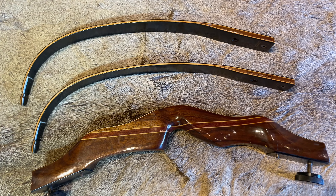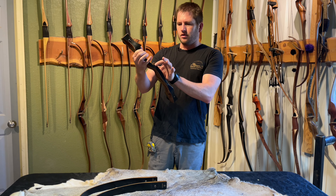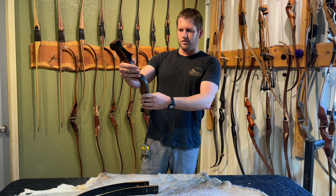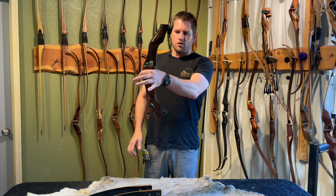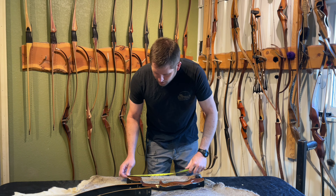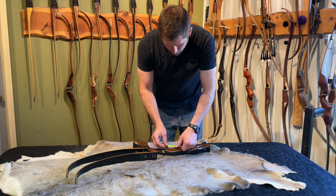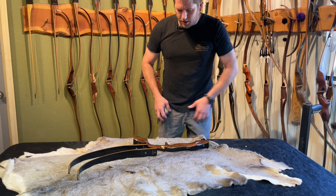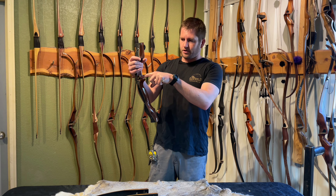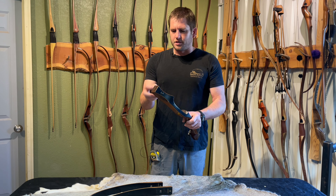The wood on it is fairly pretty. It looks like they've got maple lamination, possibly some sort of rosewood. Looking at this rest on here, you've got a really wide and long rest — looks like it's a bit overkill for my taste. However, one thing that does do for you is it keeps that hand below the fletching. You'll have no trouble on this bow of the fletching cutting your hand — it's well protected. I also measure to the center of this bow, so 9.5 inches would be the center, and then up from that, the shelf is about 1 3/16 above center. He had an elevated rest on there, so we'll have to check the tiller and see if it was tillered for that elevated rest or to shoot off the shelf. Let's put it together, string it up, and see what we've got.